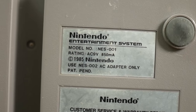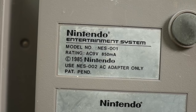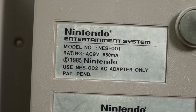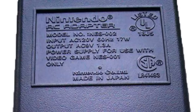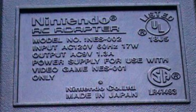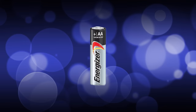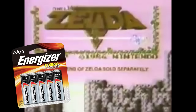Let's break this down. The NES needs nine volts and at least 850 milliamps. It also officially takes AC current, in stark contrast to most computer electronics that take DC current. The original NES AC adapter indeed outputs AC, making it very incompatible with DC devices, even of the same voltage.